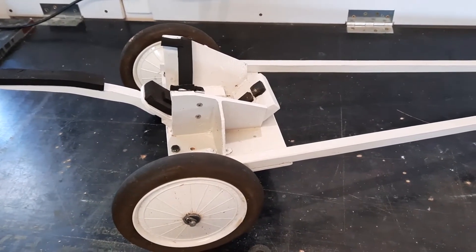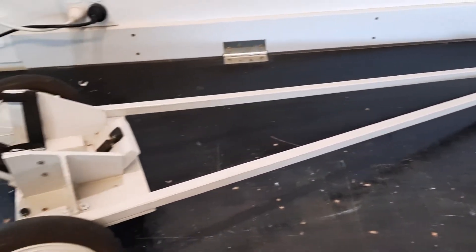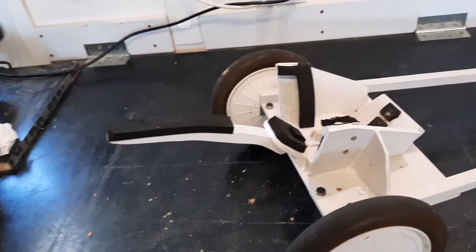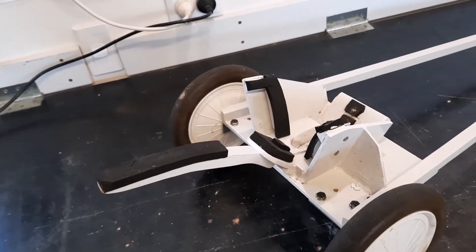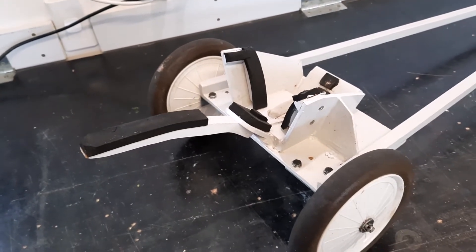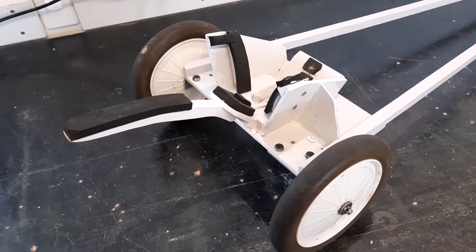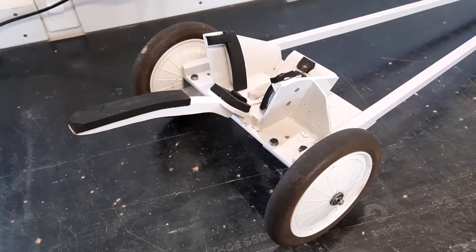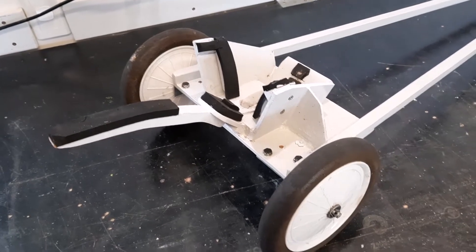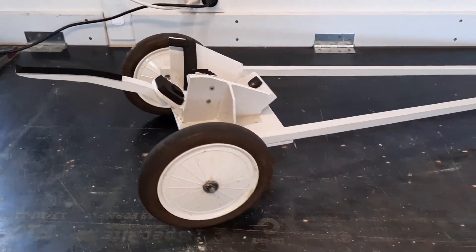The moment back to the rear wasn't being used to help it stay on the ground. So what we found was if we added this piece out the front, the aircraft couldn't tip over, and the counterbalance over the axle to the back wouldn't allow the dolly to go forward either. It's basically safe — you can almost open it full throttle now. We found that just a nice progressive opening over one to three seconds to full throttle and it just gets airborne beautifully.